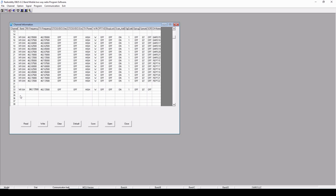So those are 3 common ways that you can deal with programming do-it-yourself repeater channels, and the various ways that radios implement the restriction of only transmitting on approved GMRS radio channels while giving you the flexibility to set multiple repeaters up on the same channel at the same time that have different CTCSS or DCS codes. So now let's take a minute to talk troubleshooting.